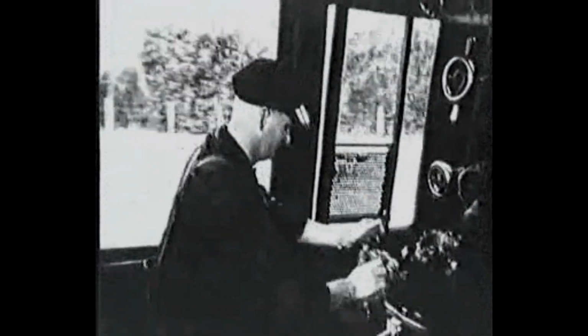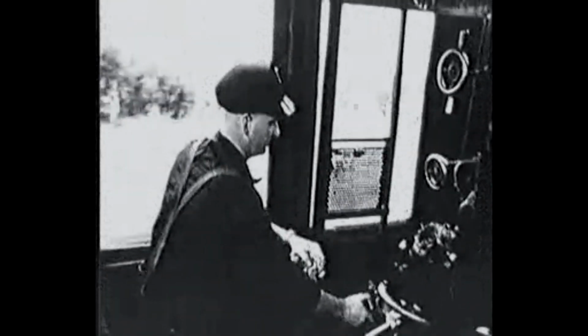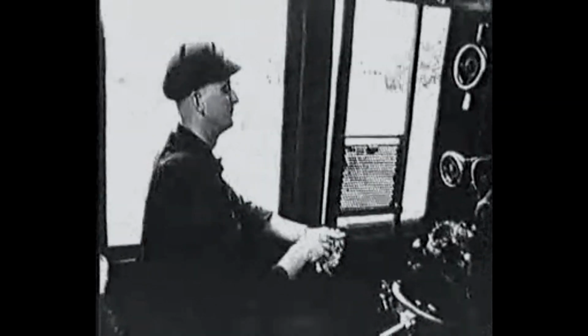Vern Jeffries shuts off the injector which pumps the water supply into the boiler, and adjusts the oil fuel feed. At the same time, he keeps an eye on the steam gauge and on the white hot glow at the fire door inspection hole. 21 miles and 33 minutes out, the brakes are applied for the first stop at Papakura.